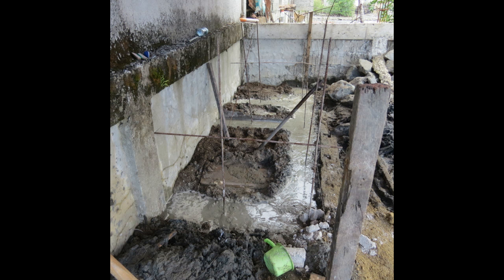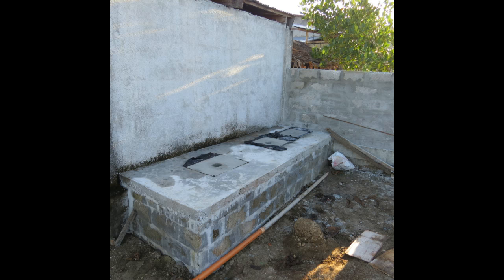The next project was to install a new septic tank. We already have a septic tank for the house, but for expansion purposes — I might build an apartment above a garage — I'll have an outside CR here, so I'm building a three-compartment septic system for additional usage so we won't put too much strain on the existing tank. Inside of about a week we had the tank built; I poured the lids myself and set them in place, and the septic tank was ready to go.